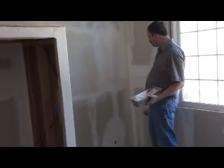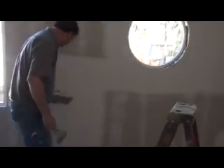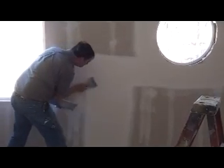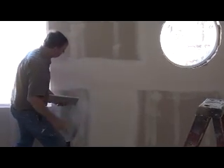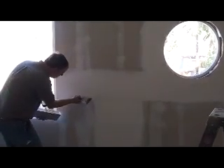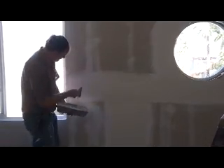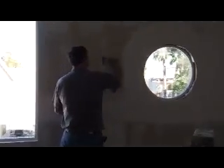I really don't sand. I'm going through and looking for things that need to be fixed. This is the final coat — it's already done. I can come by here like this and scrape the edge off if there's just a little edge there. I'll come through here just like I'm spotting nails, and that's done. If I've got an edge, I look at it and do it like I'm spotting a nail. If there are any hard edges, it's like spotting nails — that's done. There's no sanding necessary. If you need to spot your nails again, go do it.